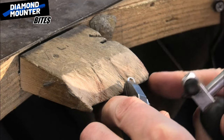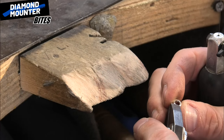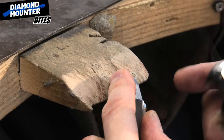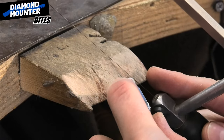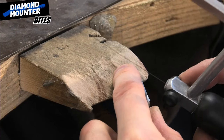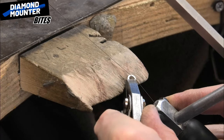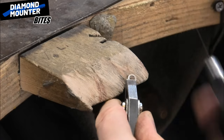As for doing the actual cutting of the claws — starting on the one I started the mark with, over the solder join. That mark I don't want to move; they're all based from where that one is. My solder join is on the top, so I start with the top mark but when doing the cuts I start with the bottom one — it's more convenient for the way you hold it and the angle of the saw blade. I'm using my finger on the saw blade, carefully lining it up — touching the top one, then rocking the blade so it goes over the bottom one, making sure it's halfway. Now gripped on there with the teeth — just carefully hold it tight and put a little nick in.